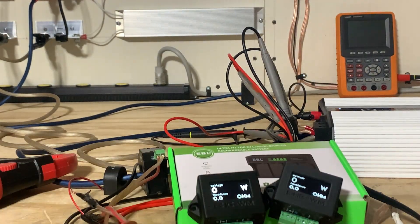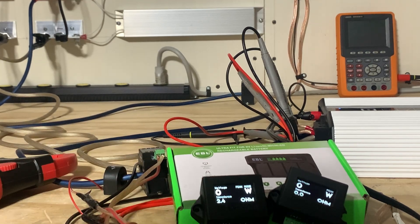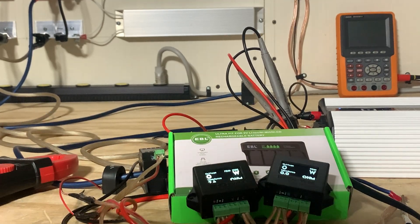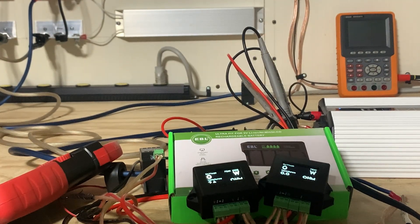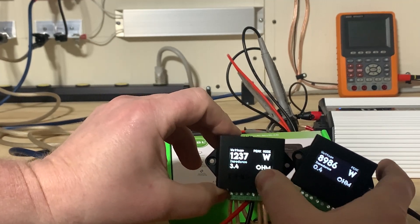Let's turn it back on and see what kind of difference this makes. They fired up fine. Version one in peak mode still shows incorrect impedance on screen. Let's reset to max. Volume 45 at 40 hertz — wow, we've got 9000 watts on version two using the version one clamp, and only 1237 watts on version one using the version two clamp.